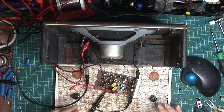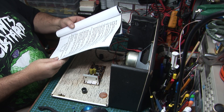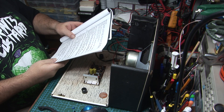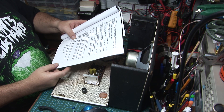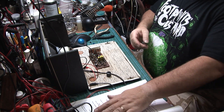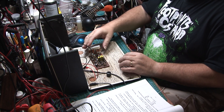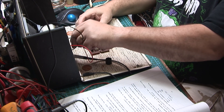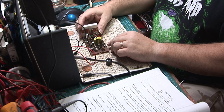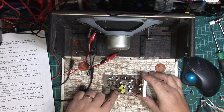The next part is to set up the quiescent current, the bias voltage, and the midpoint voltage. I'm going to read from the manual — this is a photocopy which anyone can download; it's available freely on the internet. I believe Radio Museum has a copy, and the Hacker Radio Group on Groups.io also has it. Part one: with the speaker or output meter connected, short circuit the amplifier with a link between pins 4 and 5 of socket 1 — so this needs a shorting link.